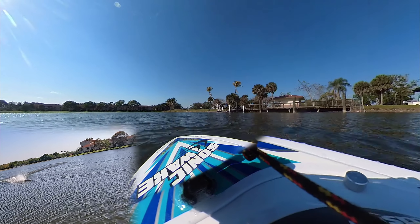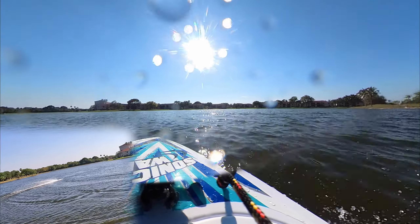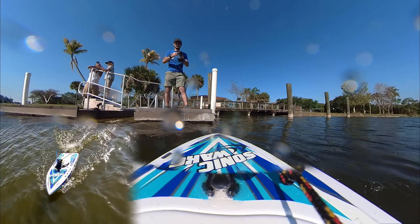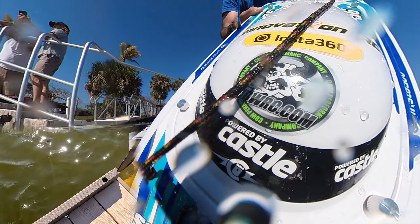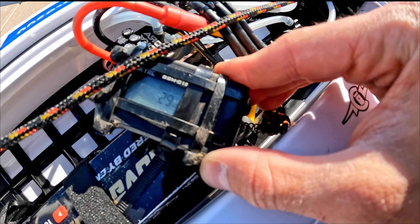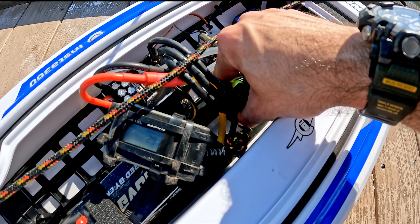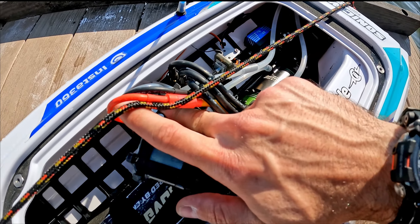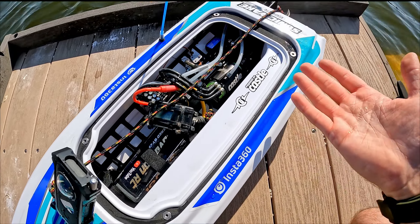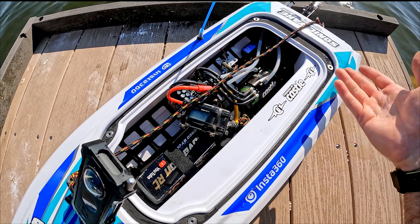Here we come back. Let's see how fast that was. Our top speed: 29 miles an hour. So with the KV drop, we actually dropped speed, which is pretty obvious. But the motor is cold, which is amazing — motor is not even feeling it. The ESC is also very, very cold. That is a pretty pleasing thing that everything is at least running cold, because if it was still hot and slow, well, that's not good, something's wrong. So let's see what it'll do on 6S.